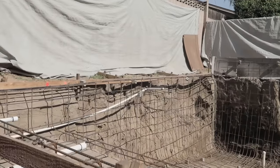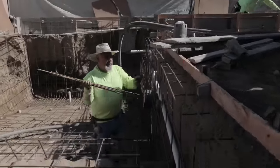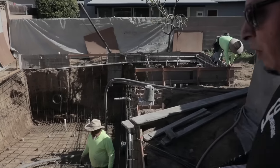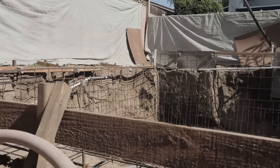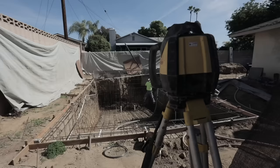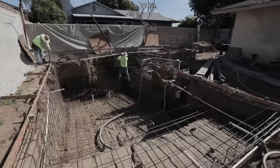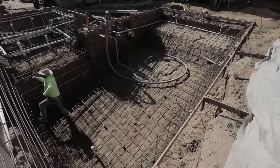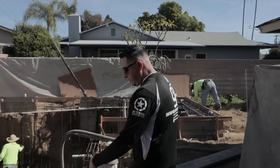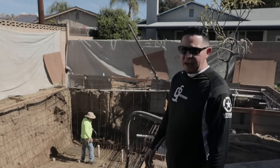These guys laid out the lines. These wires are to give them a reference of where they're going to cut the shell. The pool walls are 12 inches thick. You want to make sure the rebar is 3 inches off of the dirt — that's why you have adobes on the bottom. These guys know what they're doing; they try not to walk on the rebar and smash it down. You'll see a lot of people flatten it all out, rebar sitting on the dirt, and then it doesn't set right within the floor of the pool. The floor of the pool is about 9 inches.